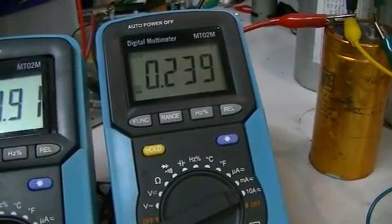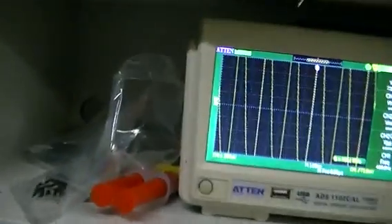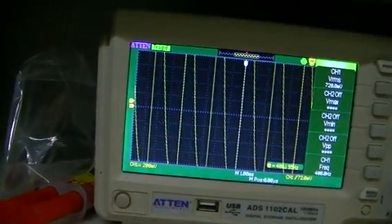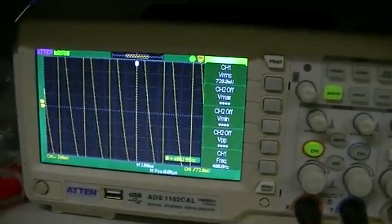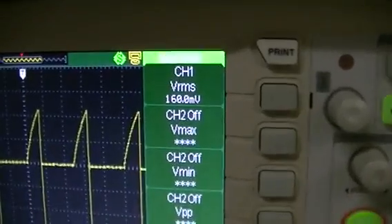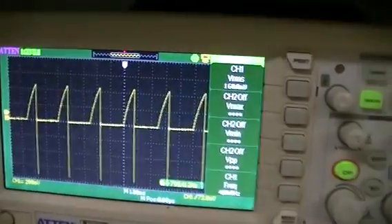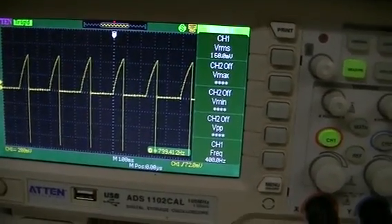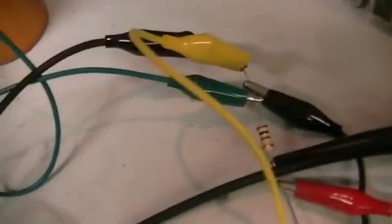Unloaded: 243 milliamps. Loaded: 239 milliamps. So we've dropped slightly in input power. But have a look at the current flowing through the primary coil - now it is loaded, now it is unloaded. We're going from a situation where we have 160 millivolts across our 100 ohm resistor - and that is RMS - to a situation where we load the secondary and the primary now has 720 millivolts RMS flowing across that coil.